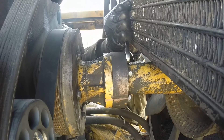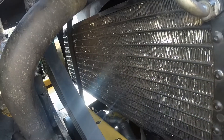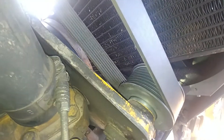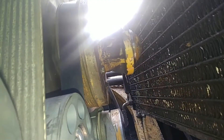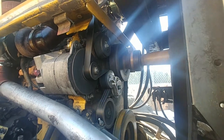Tighten those bolts and make sure everything is torqued. Put that bracket back — one bracket was actually missing on this machine. Check out the result: a shiny brand new compressor, new belts, new idlers, new rollers, new tensioner. Beautiful C7 ACERT Caterpillar diesel — this 535C Caterpillar log wheel skidder will get a second life. Its engine is great, but those pulleys and accessories were just a mess. Take care, guys — see you soon!